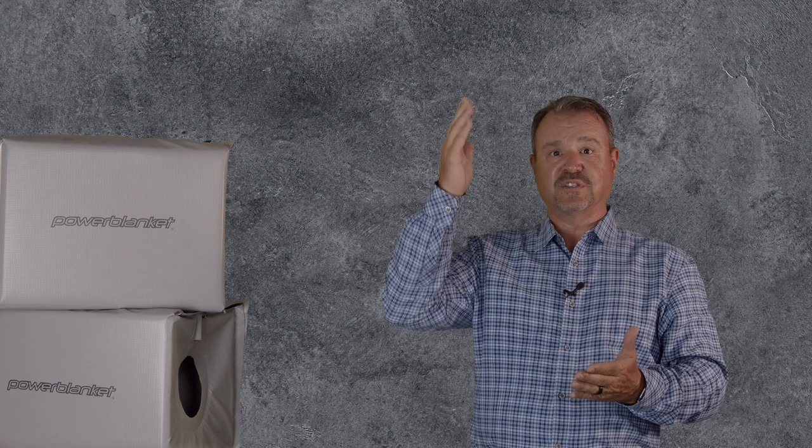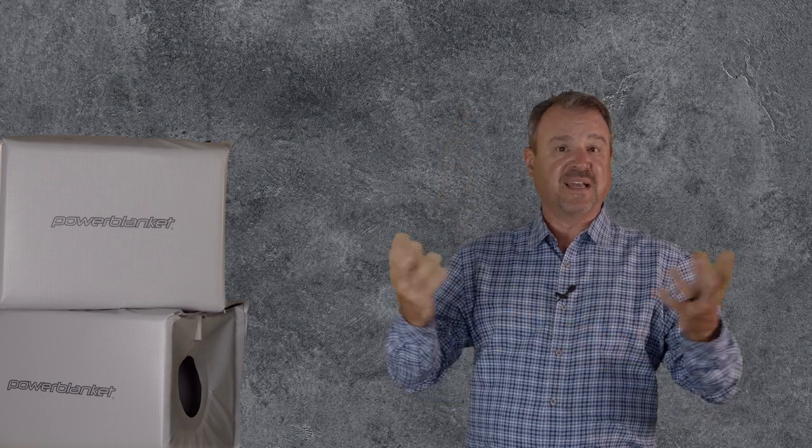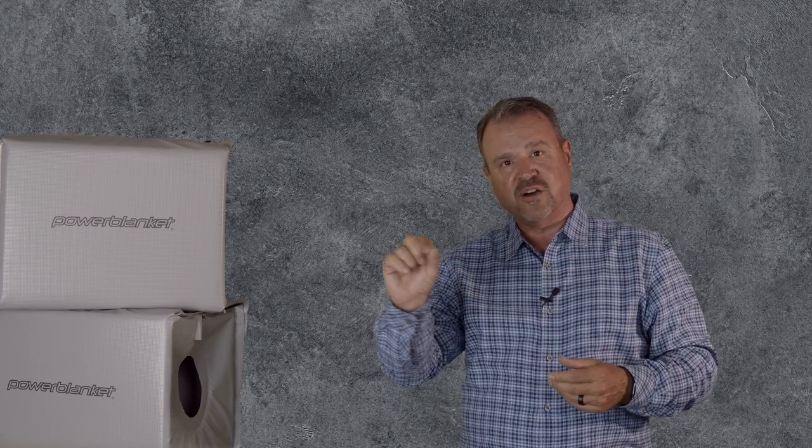The problem is sometimes the contents of that tank can't see temperatures that are of a certain rate, so you have to protect that product from the heater. In other words, if the heater runs away and gets to 800 degrees, it may catch something on fire. So what a lot of people do is take that over the side or screw plug or flanged immersion heater and they put a thermocouple or a thermostat on the sheath of the heater just for over temp protection.